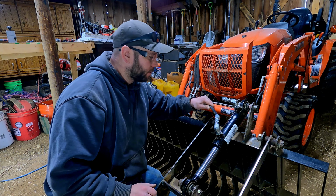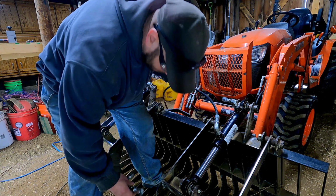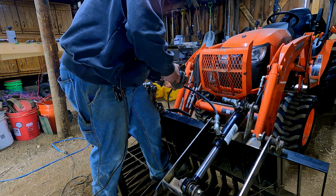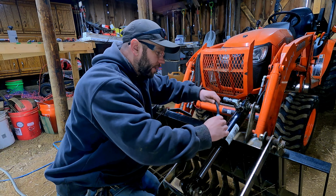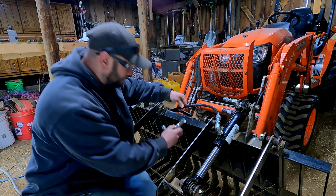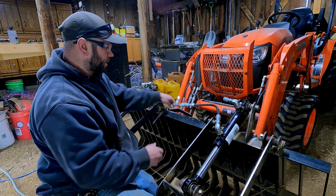So I got my first cut made. We'll go ahead and stick that into the crimp fitting. We'll get our T positioned where we want it. I think right in here's pretty good. And we'll make another cut right here. And I'm just going to take some compressed air, blow that line out real good. I think we are ready to go with that hose. There we go. Our first hose is cut.